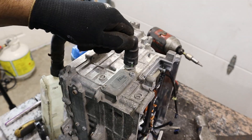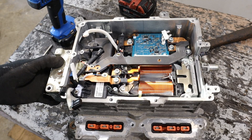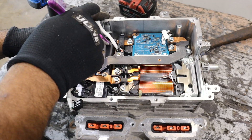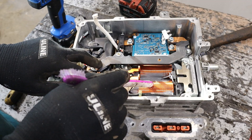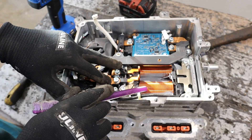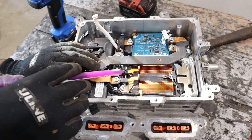There's the breakout board. I'm going to pull off this expansion tank. Taking a look under the hood here you can see we have DC voltage coming in from underneath this block to these two terminals. This black piece is a smaller smoothing capacitor of the two; there's a larger one down at the bottom. Power comes in through the reactor, which is this giant coil, and this coil is going to amp up that voltage to a much higher voltage so that you can run those AC motors a lot faster when you need extra power and acceleration.